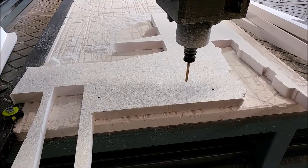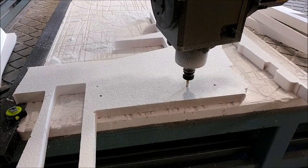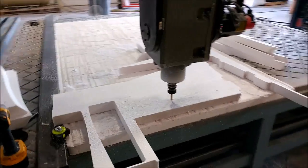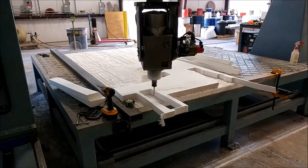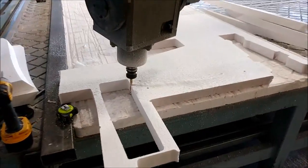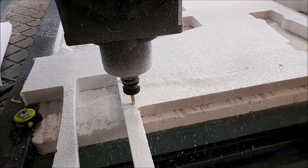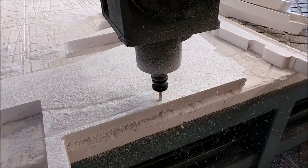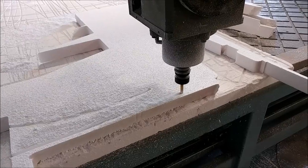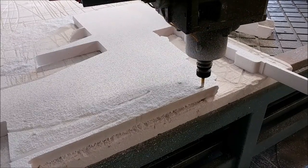Next up I had to create some braces for the nose compartment door mold, to give that a little extra strength and also make a stand for it to sit flat when the part gets laid up. As usual, using the three-eighths-inch ball mill with the long flute, cutting two-inch foam — four different pieces that make up the brace. I'm getting pretty good at throwing that together; it doesn't take long to get it into SolidWorks, create the shape and the tool paths. I can basically do one of those in about 20 minutes now, and then it only takes a few minutes to cut.